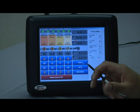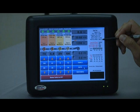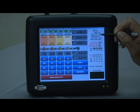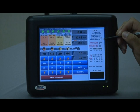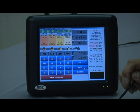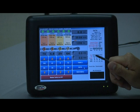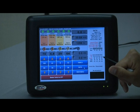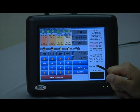The data side window: hitting the Data button brings up valuable reference information on the right-hand side — items such as ground speed, area per hour, seeding time, manual speed setting, machine width, wheel factor, high and low RPM levels of the fans, rates for each tank, capacities of each tank, calibration factors, auger type configured for each tank, actuator position, and metering auger RPM. It also tells you whether a switch box is connected, which can be a useful tool to confirm everything is connected properly.